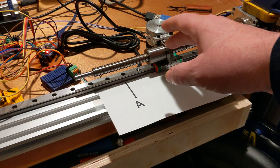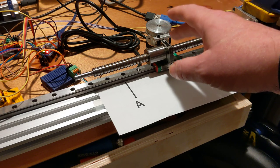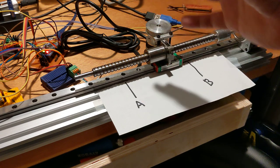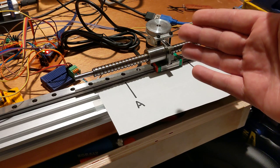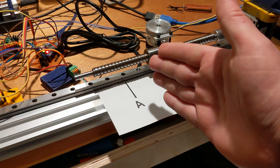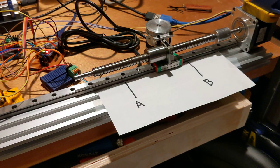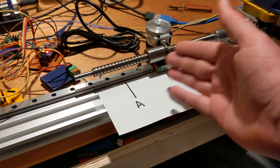The other piece here is, if your feed rate is too slow, then you're going to queue up the buffer, and on the tail end of the buffer the larger feed rates won't actually get into the planning buffer, so nothing happens to them, right? And then you never get the acceleration, or you move past the point that you want to go, and then you start to ramp up your acceleration. So that's one of the main factors in getting the smooth jogging motion.